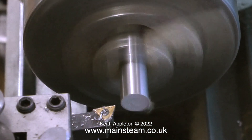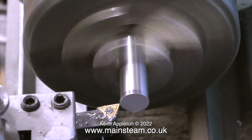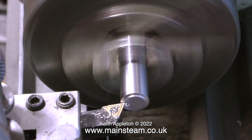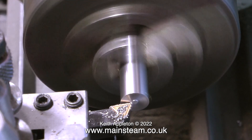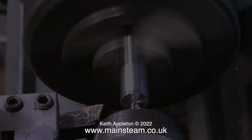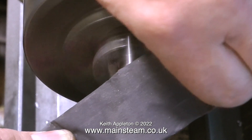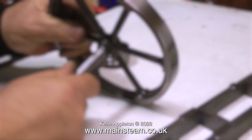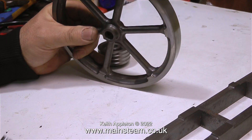This is a very good fit on the crank web, so it's quite successful. I cut it to length on the bandsaw, then reversed it in the chuck to clean up the other end. On the drawing the crankshaft length is four and three-quarter inches — four and three-eighths up to the shoulder and a further three-eighths, which is four and six-eighths, or four and three-quarters. I face across the end and use the center drill again. Always remove the sharp edges from a 90-degree cut, but make sure you don't get your hand caught in the chuck doing it.